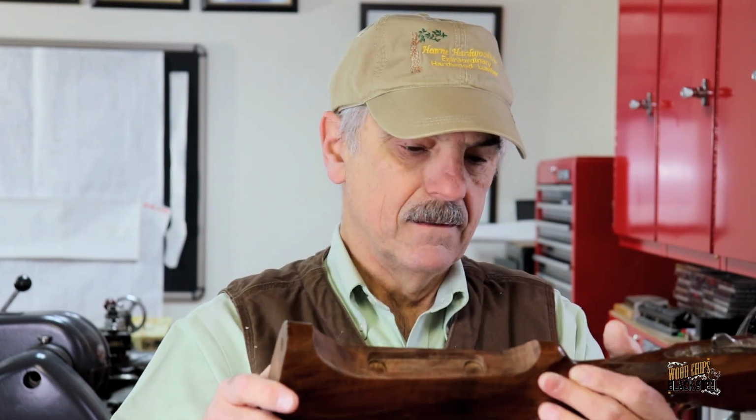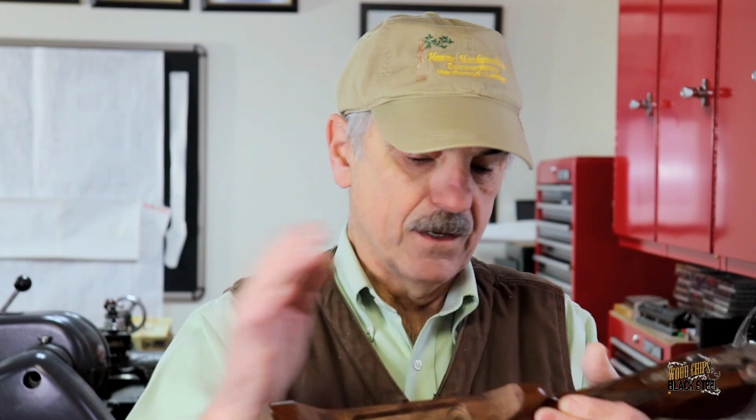It takes effort. So again, I had to build up finish in order to level it out to that original Browning finish. That's been a couple weeks just trying to build up the finish in those chips, one little dab of finish at a time. And then finally you get it thick enough that you can sand it with 600 grit paper and begin to blend that off. Anyway, that's done. I finally got all that finish blended off.